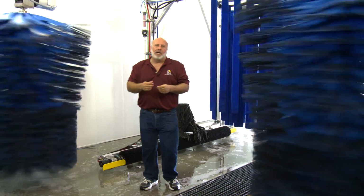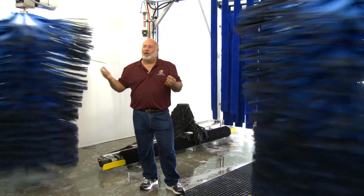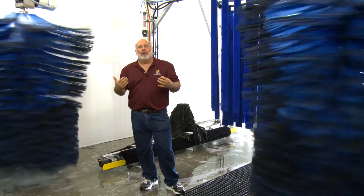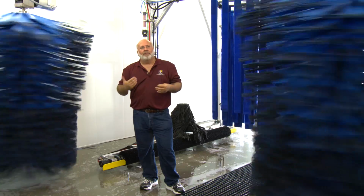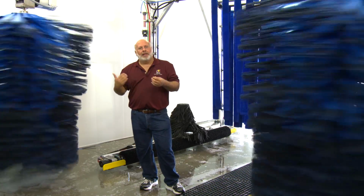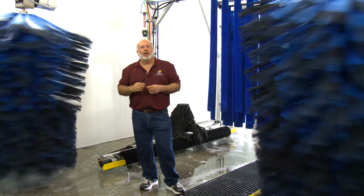We've done this on a couple of side brush videos, but basically it's the same. We'll put a piece of something on there that we can count as it spins, and we'll time it for 10 seconds and multiply it times 6 and find out how many RPMs we have a minute. So I'm going to have him shut this down. I'll attach this little piece of wire to one of the cloth materials, and then we'll start it up and time it again. So again, we've got this running at 60 hertz.